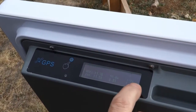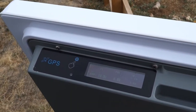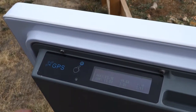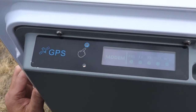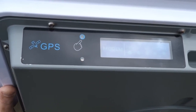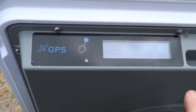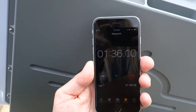Signal gives you a max hold, which is a handy reference point to tell you what your highest signal was. I'm going to hand-tighten down the azimuth bolts to lock that into place. The next step is polarity — you rotate the entire antenna system. You can see we've already got receive lock, which is great news. I'm going to rotate this to 44 degrees and lock it down. We've got 100% signal again, and looking at the stopwatch we're only about a minute 30 into the pointing process — pretty quick and easy.